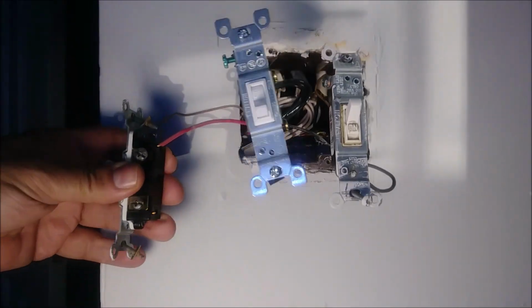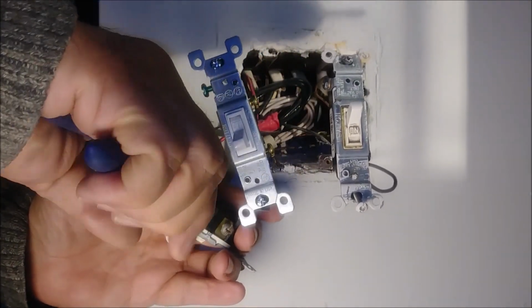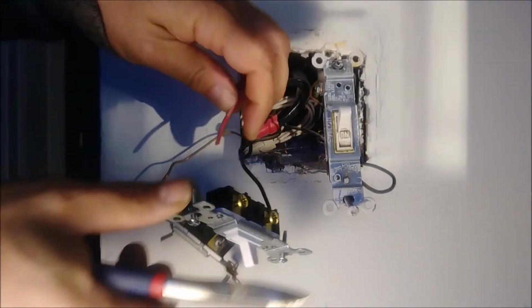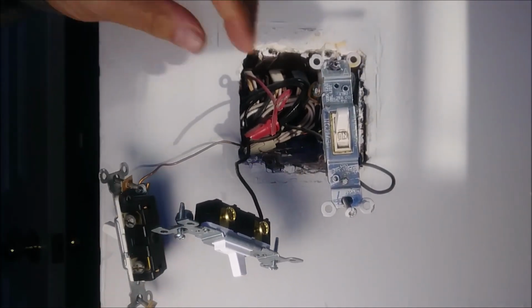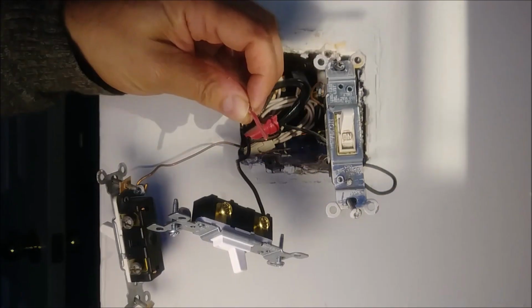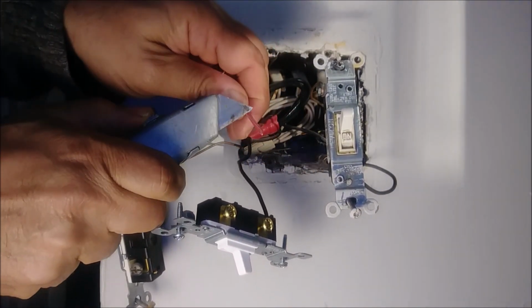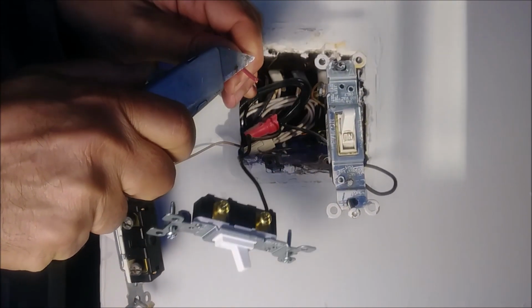Okay. So here I'm cutting it. I'm cutting this wire, which is the wire that has to go on top of it. Okay. And that's the ground also. This one I will leave for the last one, for the last connection. And what I'm going to do now, I'm going to remove the insulation here, 3/8 of an inch or half an inch, depends how much you feel comfortable.